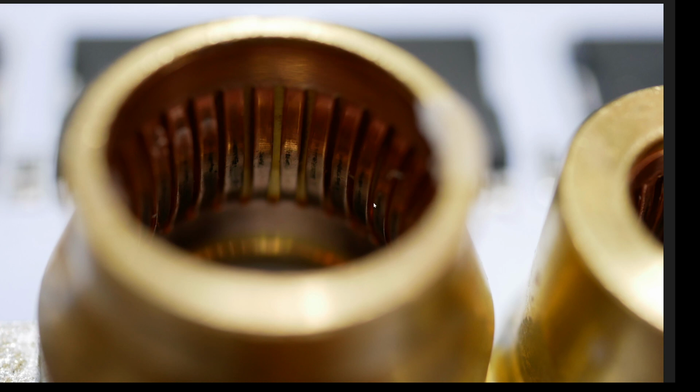It just didn't arc through like it did on that battery minus one. But they still got really hot. It's the only reason why they are oxidized in a lighter color like this rather than that reddish copper color like this, because they got super hot and it left all this carbon on the copper as a result. So I changed my opinion about these things being great. Clearly they're not. Clearly they already fail, even on something that's got zero time on it from me. Pulled it right out of the box, opened it up, and see this. Over on this one here, you can see the same kind of scorching. Something really catastrophic happened here, and they repaired it and sold it as if it was new.